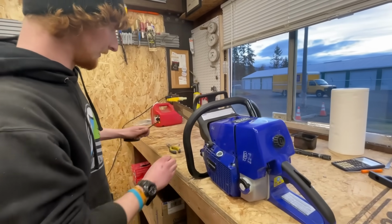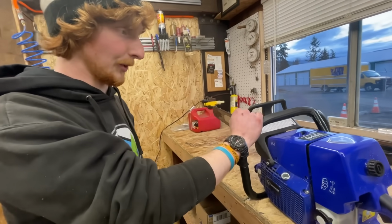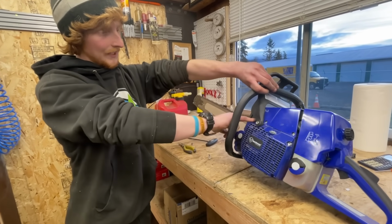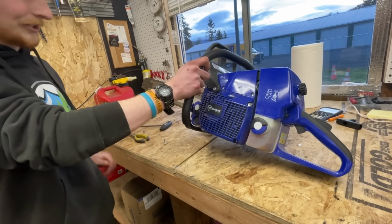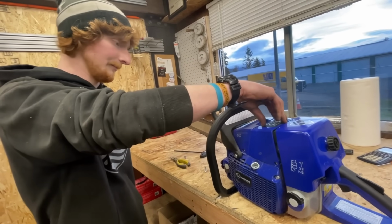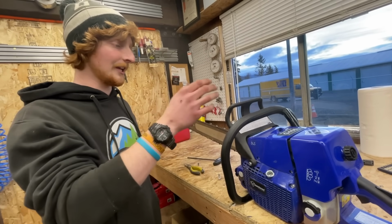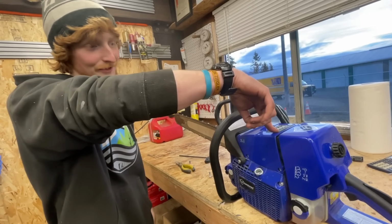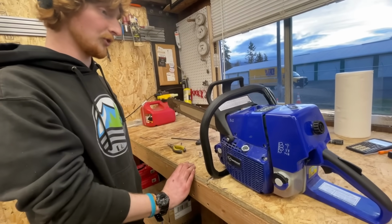So the Chinese saws, it's pretty new to see these. It's basically an 1120. They model this off like an MS460, because it has this big chunk of plate here. So it's probably like a 52 millimeter top end and all that stuff. In the past, you could buy a kit from HL Supply to put one of these together and it'd be all orange parts. But more recently, they came out with the 660, or the G66 something, a put together 660 from China.